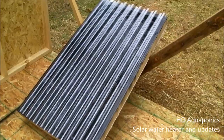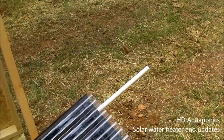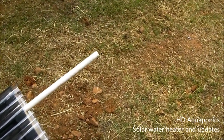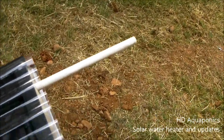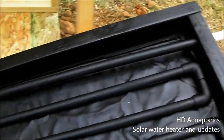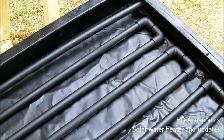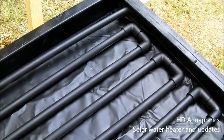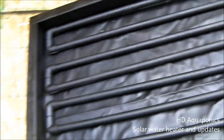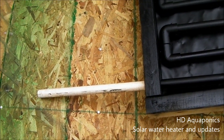So here's how we're gonna save some money — this is our solar hot water heater. What's gonna happen is that recirc line we just saw: water will be carried from that one-inch recirc line, downsized to a half inch, and then run through all these pipes that I painted black. I've lined the bottom with some PVC pond liner just to save a little on paint using leftover material. Water will travel through these coils all the way down and come out the other end to the other tank.